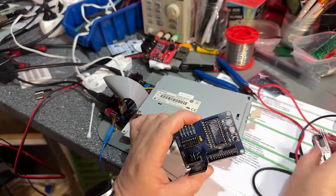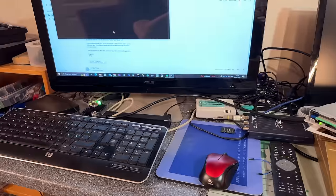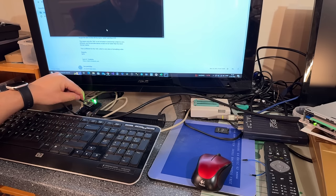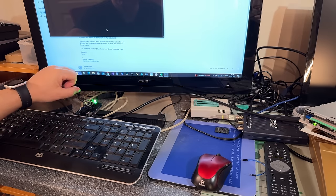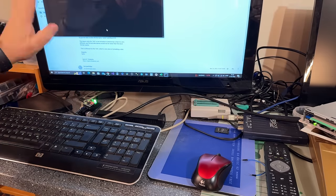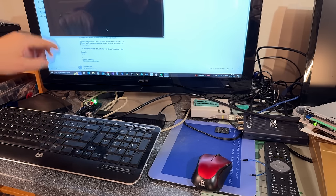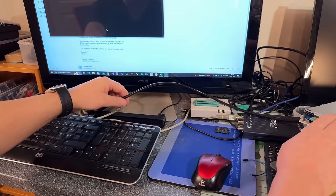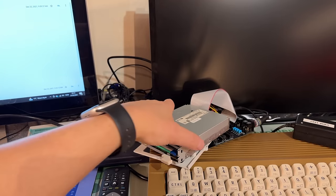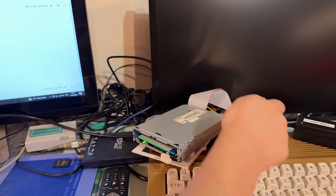You hook it up and connect the microcontroller to your PC via USB. I've programmed the little Arduino Pro Micro that you need for this — it was quite easy. I'm not going to go into all the details, but you need some software on the computer. This is a Windows 10 machine and I used the OpenCBM software. I've connected the drive to this little device via the USB micro connector.